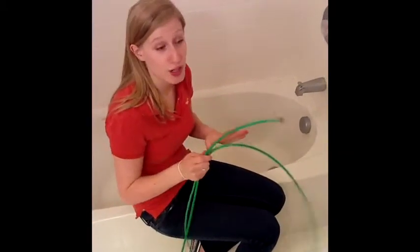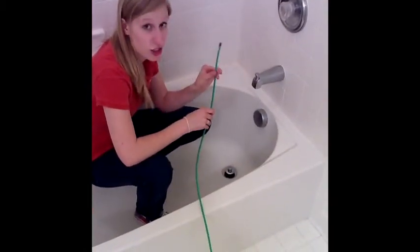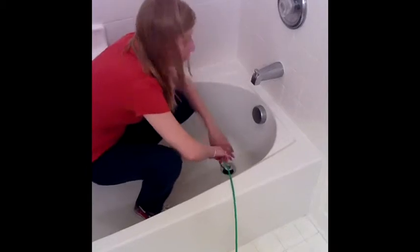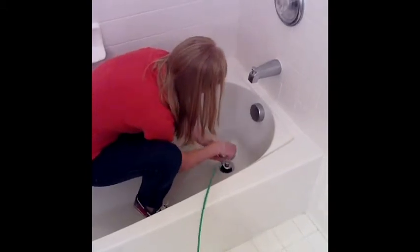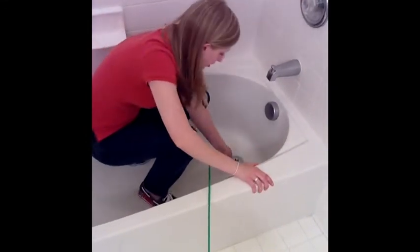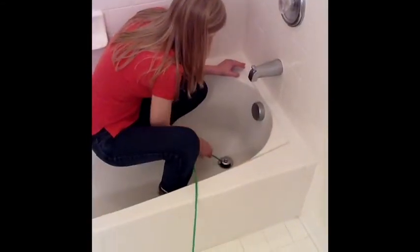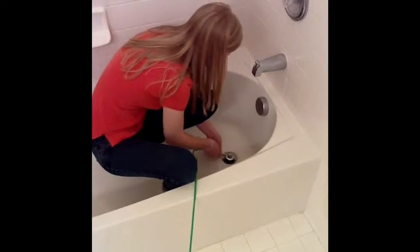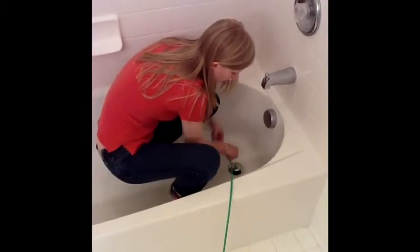This is a classic shower and tub combination. We're going to use our Easy Drain Jet to unclog our drain — the same steps apply. Put the end of the Easy Drain Jet into the drain. You have to get past that little flap, like always. Whether you're putting it in or taking it out, you do not want to force anything. If it gets stuck, just move it around, wiggle it until you get by. Now that our Easy Drain Jet is in the drain, we're going to pull it up to hit the flap again and turn our water back on. Go down and up as much as you can — you're literally flushing out the dirt, clogs, hair, and everything.